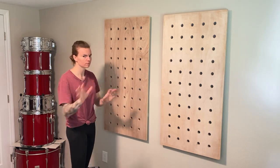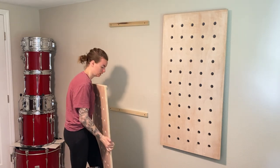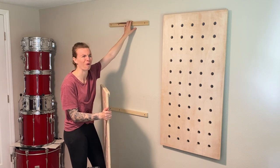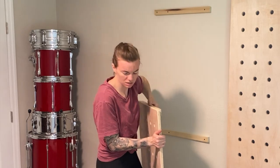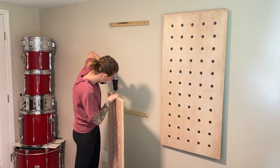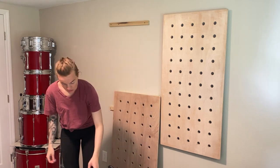Guys. Okay. Follow me on this. I'm going to secure the top by drilling from here into here so you don't see the screw hole. Genius. But that means I gotta drill a pilot hole first. Need a longer screw. Dang it.